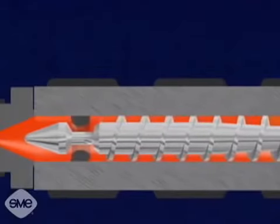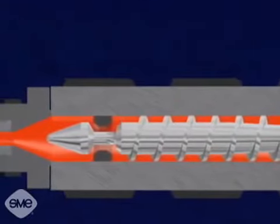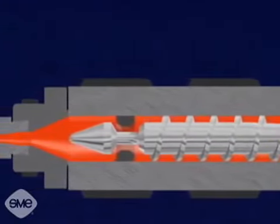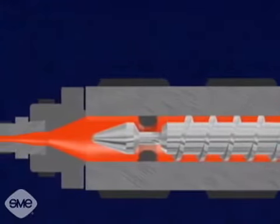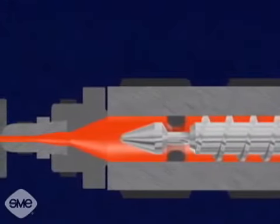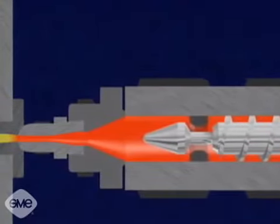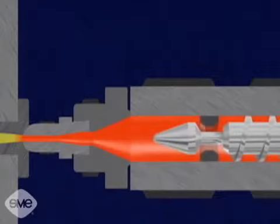This section acts as a pump. The tip of the screw has a one-way valve, which lets the material flow only towards the nozzle end. The force of the plasticized material pushes the screw back as it turns, building a chamber of plastic in front of the screw. When enough material for the injection shot is melted, the screw stops and pulls back to decompress the material.